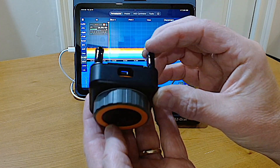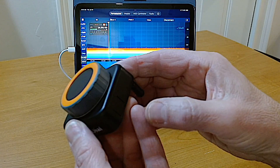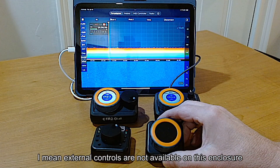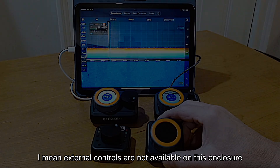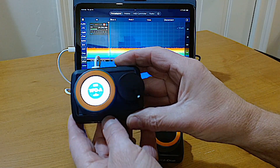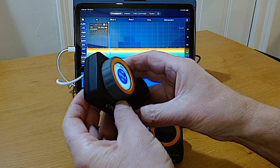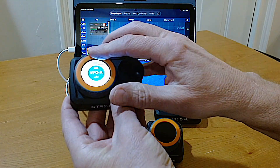The Dial is available in several enclosure styles, including the same enclosure used with CTR2 Micro and CTR2 MIDI. External enclosures or the CW paddle jack are not available on this enclosure due to size restrictions. The next enclosure option is a new-age enclosure. This enclosure provides more room for external interfaces and is available with one encoder and a paddle jack, or two encoders.